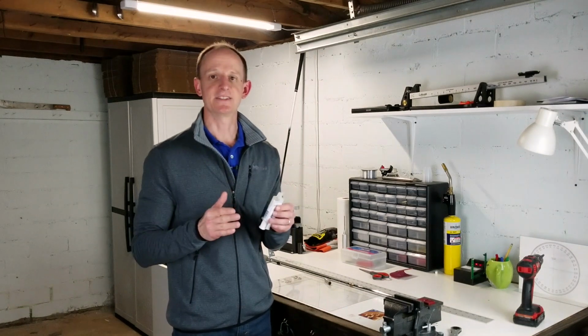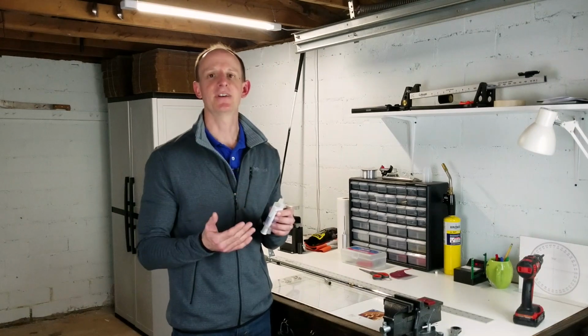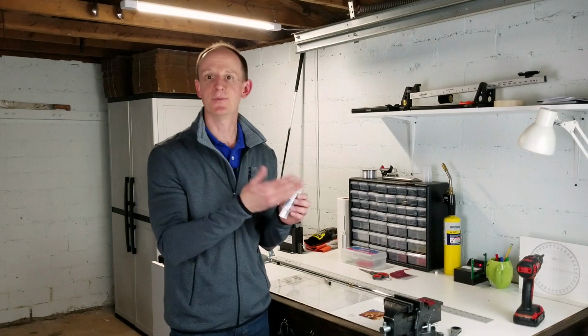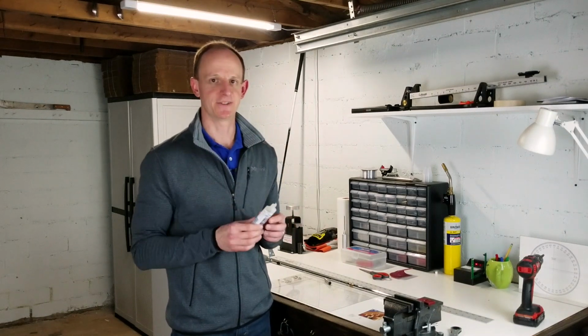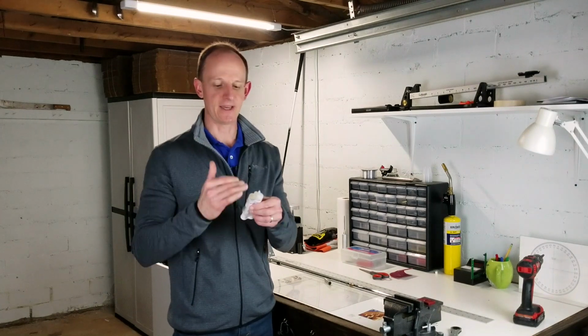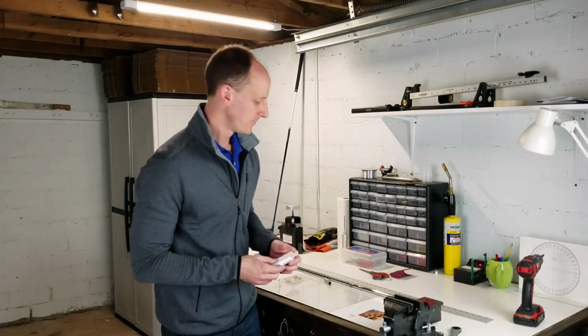In most cases, it's going to be a 1-to-1 ratio. You'll want to look at the package to make sure. Again, there are exceptions. Certain epoxies have a 2-to-1 ratio, 10-to-1 ratio, it depends. Most of the golf ones are usually 1-to-1 ratio, so equal parts. In syringes like this, it's very simple because they come out at the same time, so you know you're basically getting an equal amount of each.